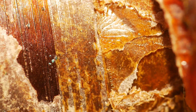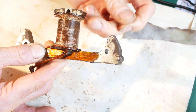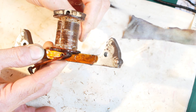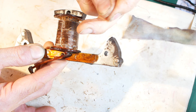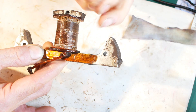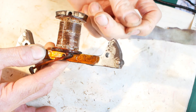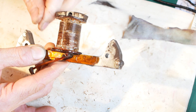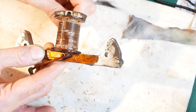You can see the layers of paper soaked in shellac over towards the right hand side of the shot. Even when I got to some better layers of the coil the wire was still incredibly brittle compared to the new wire, and it was a frustratingly time-consuming process to get it all unwound. I kept measuring the coil during the unraveling process and it remained open circuit, so I was expecting more corrosion as I got towards the center.